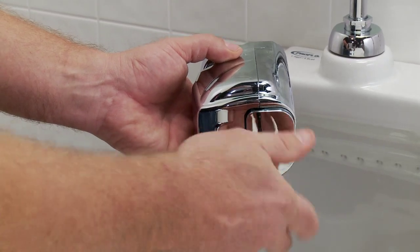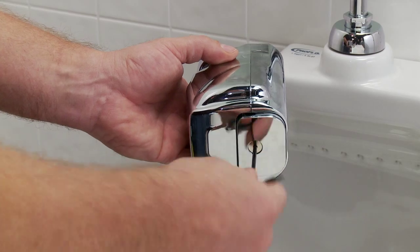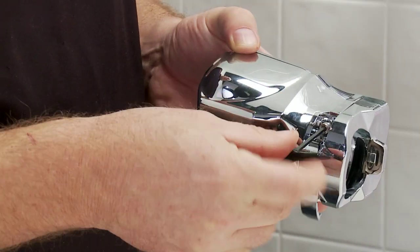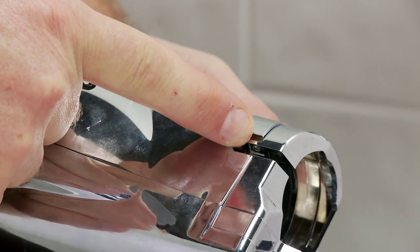Using the provided Allen Wrench, remove the battery compartment on the Auto Flush Clamp Unit. Open the hinged screw covers with the Allen Wrench and loosen the screws to leave a 1¼ inch gap between the base and the mounting cover.